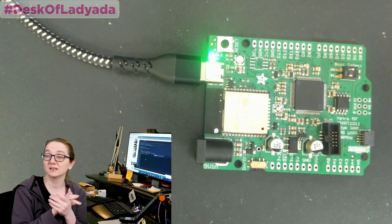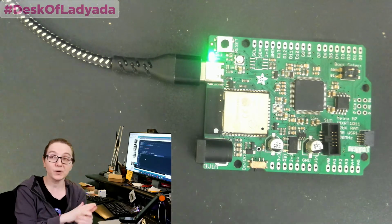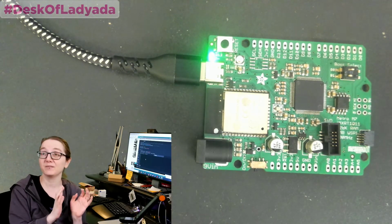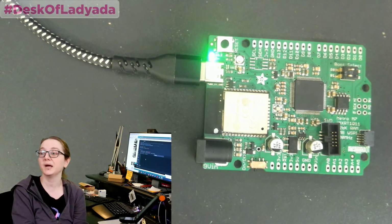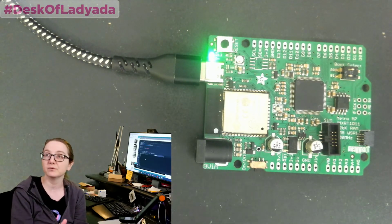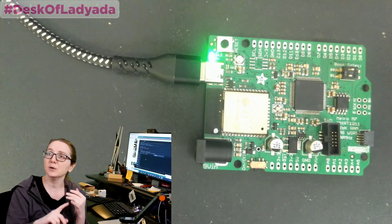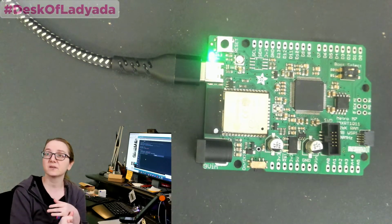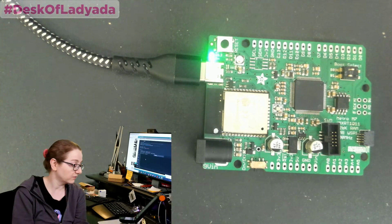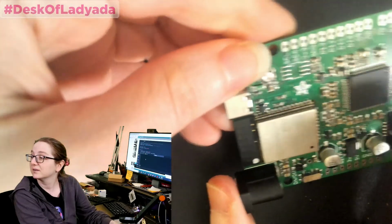We'll be adding support for all these chips soon. I'm surprised, the support we have is quite good, but we'll be adding more, I think, this week: PWM, IO, and UART if we haven't done it. But we already have SPI and I2C and analog inputs. A lot of stuff is already working. So good stuff. So that's the IMX. Any questions about IMXs? Doesn't look like any questions.